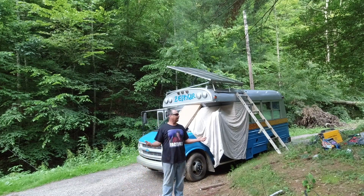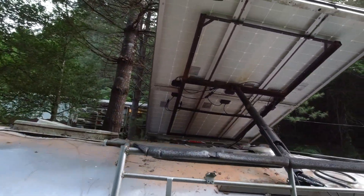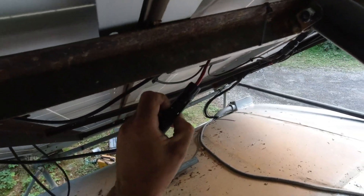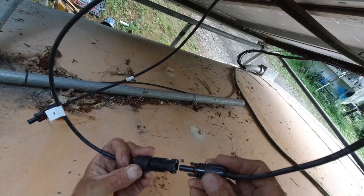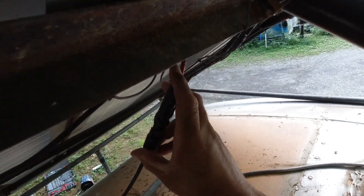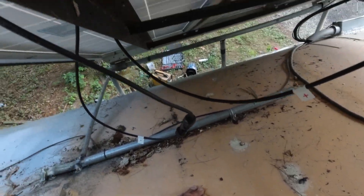Zephyr now has his solar system back — well, almost. One more thing I have to do. We're going to hook that solar panel back up into the array. I'm going to unhook this one — negative will go into the positive of this one, just like that. Then this positive of this one is going to go into the positive that is going into the combiner box over there, then down into the charge controller. So that has our solar array connected.